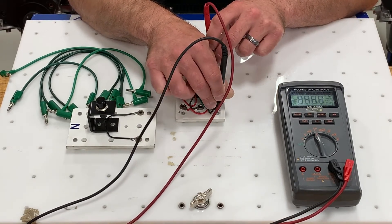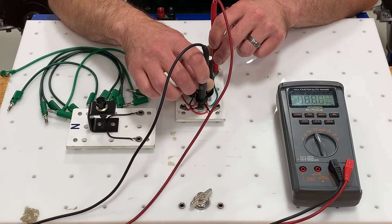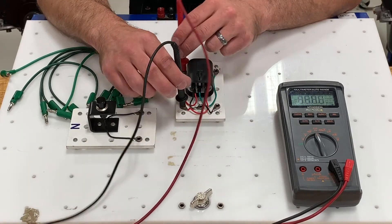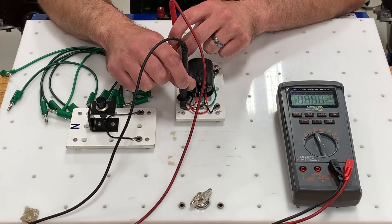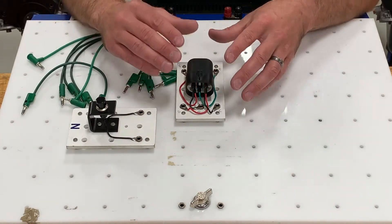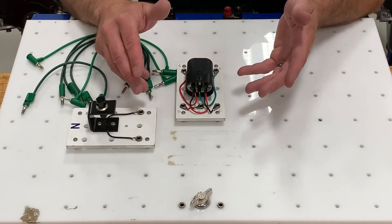You can see it's pretty minimal resistance — that is just a switch that is currently closed. Moving over to the other wire from those larger terminals on this relay, it is open. So I'm pretty certain that those three contribute to my action circuit. Going to the other side and checking that, I get 70 ohms. That 70 ohms is the resistance of the electromagnetic coil on the control side of the relay. With my relay coil identified and knowing where the control side is, let's go ahead and set up a circuit to make this relay work.